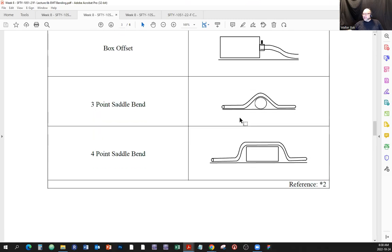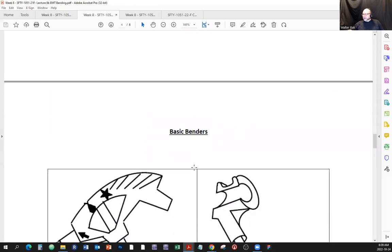Of course, I'm just going to bring to your attention that there is something called shrinkage involved. When you bend the pipe, let's say you have a regular 10-foot piece, from here to here it's 10 feet, and you do the bends. After doing all those bends, the distance from here to here is not going to be 10 feet, it's going to be a little bit shorter, right? Because you're losing some of the length of the total pipe for the bending. So that's considered shrinkage, right? And there's a way to calculate that.